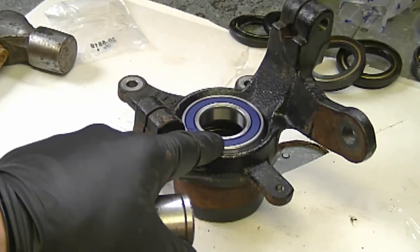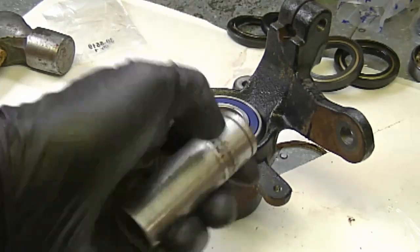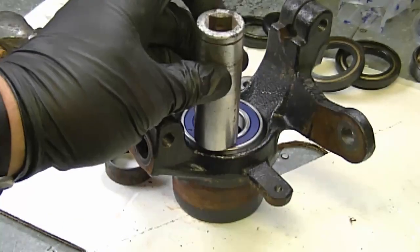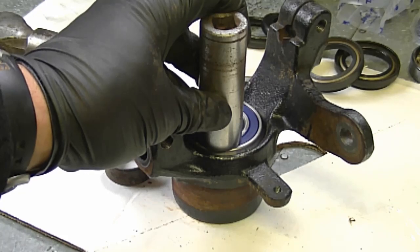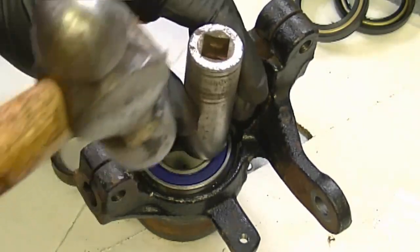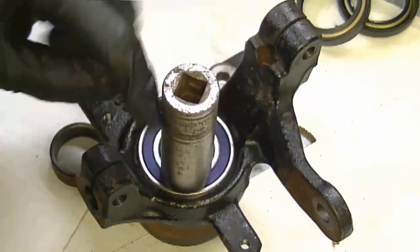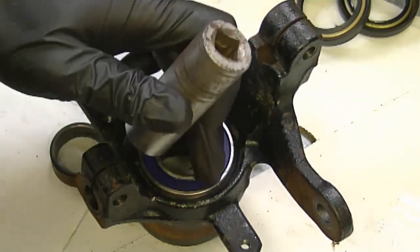As you can see it's starting to go in — it's about halfway in. It's a bit hard to hit it now because part of the yoke is there, but I'm going to use a socket and just tap it on the outer edge of the bearings only. When you do this, go all the way around so the bearing goes down evenly. All the pressure on the bearing should be on the outer part.